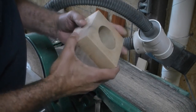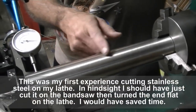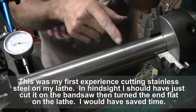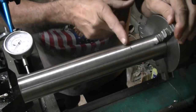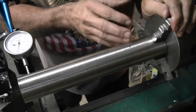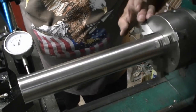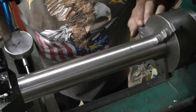That looks like a really nice block — I think that's going to serve our purposes perfectly. I've got this piece of stainless steel pipe chucked up in the lathe with an indicator on it. My goal is to cut it off at this black mark. I've got it chucked up close to this end for the cut. I've got an indicator on here and I'm spinning this to make sure it's straight when I cut it off. Look how far off this is — you think it's straight in the chuck, but it's not.